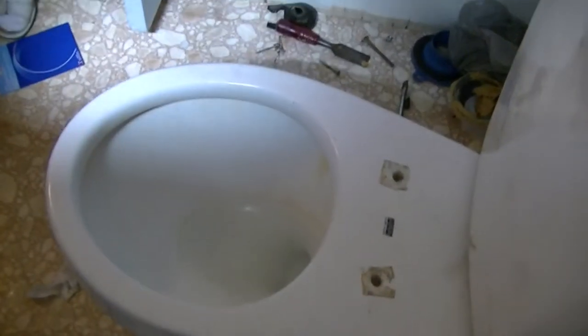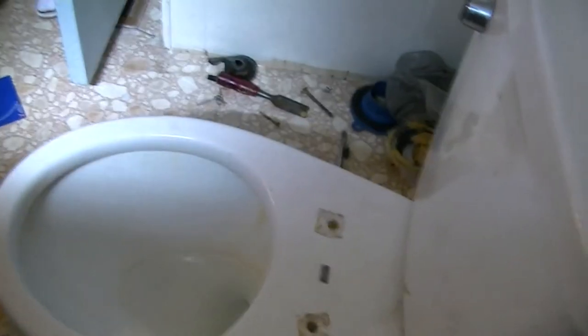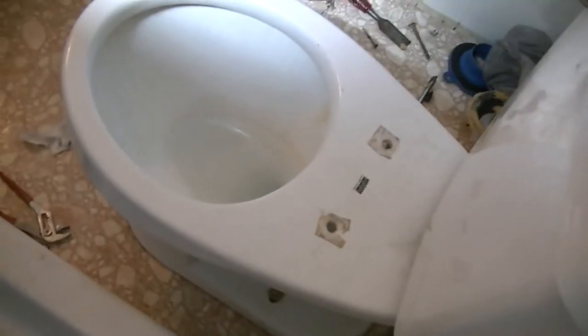There's still water in it — why is it still leaking if you've flushed it? The way to get all the water out is to pull the toilet again. It's got a P-trap in there that keeps the water in, and having water in there is good because it prevents sewer gases from coming out. That's why it's there.